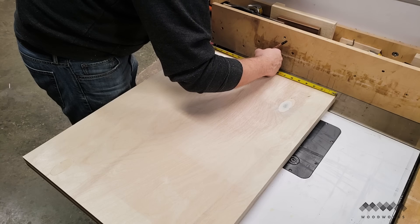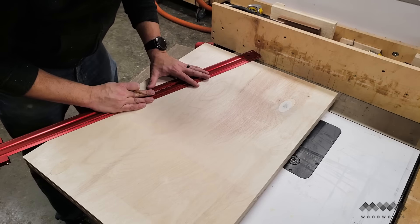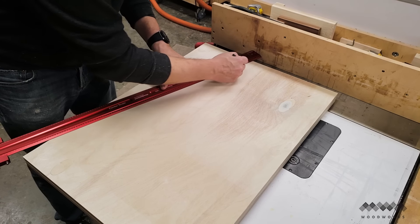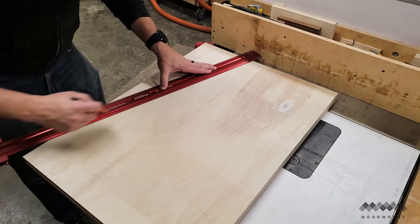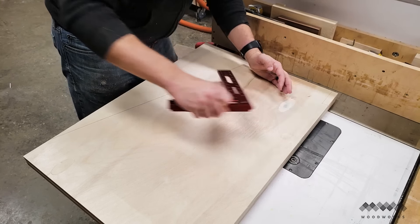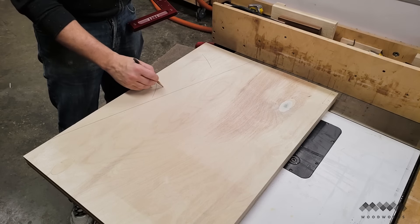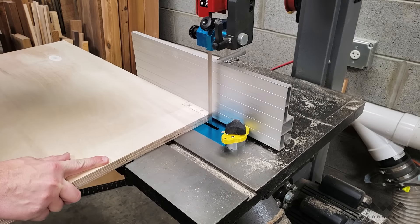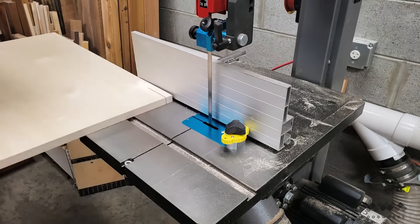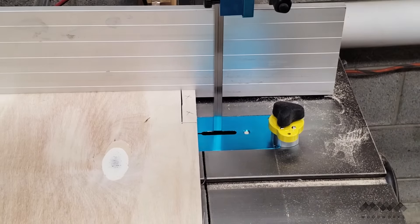The final bit of cutting on the project had to do with creating the angles and notches on the side panels. I really wanted the base of the cart to angle upward to where the cyclone bucket would sit. This would give the cart a lighter look and give easier access to the switch on the vacuum. The notches will allow the stretchers to nest into the cart, keeping the overall look clean. The notches are fairly easy to take care of at the bandsaw — I used a magnet as a stop, set my fence to the proper distance, and cut the long edges, then moved the fence back to finish the job.